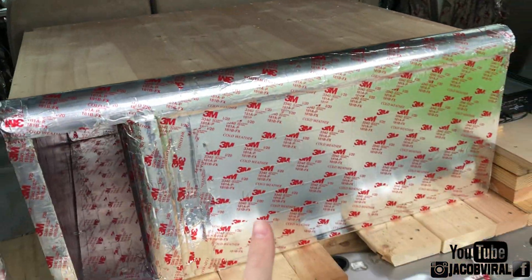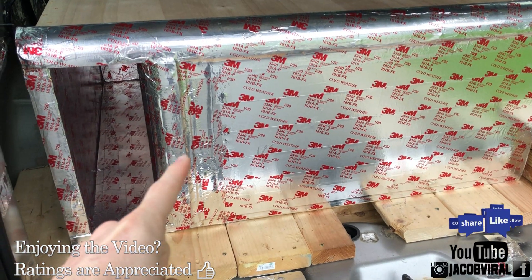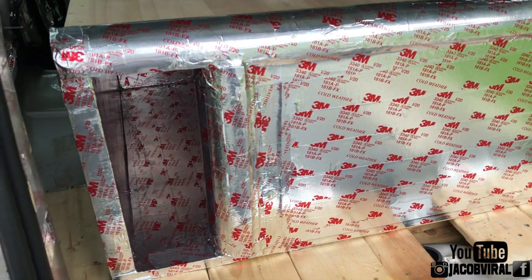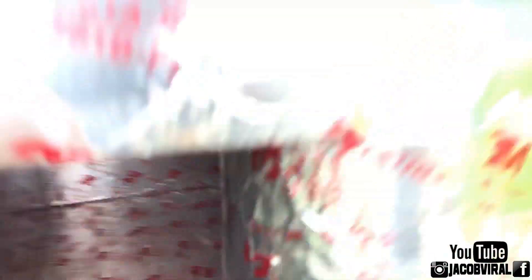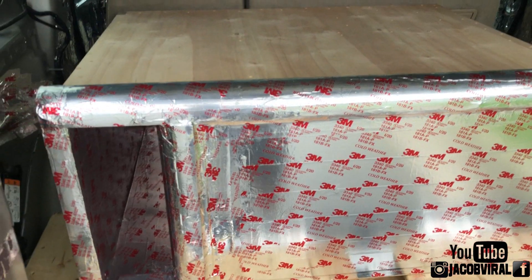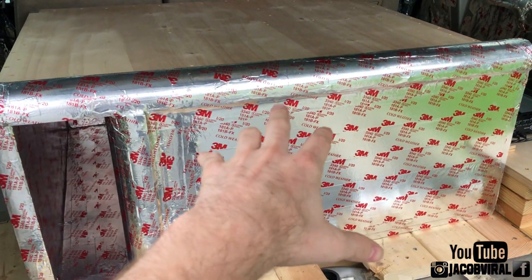Going forward, I do plan to do some tweaks and adjustments on the fourth order. I don't plan to go sixth order just because I'm more comfortable with fourth orders, and I personally like fourth orders more on an output basis as well as cone control. I feel like I have more testing variables to tweak my sealed section and ported enclosure section to get higher output near peak, though my bandwidth won't be as good. For the current state, I'm going to stay at fourth order.